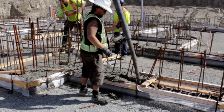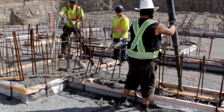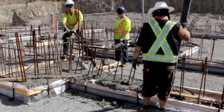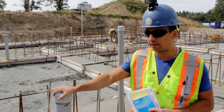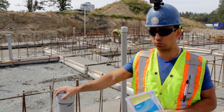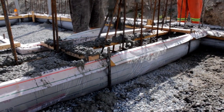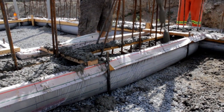We've got seven of us here today. We poured 60 meters in two hours, which is fantastic. Even if your excavation isn't flat, the bags conform to the ground. So you just lift up your footing to where you need it to be, staple the bags on, and just make sure it has enough slack to pack out and you're golden.